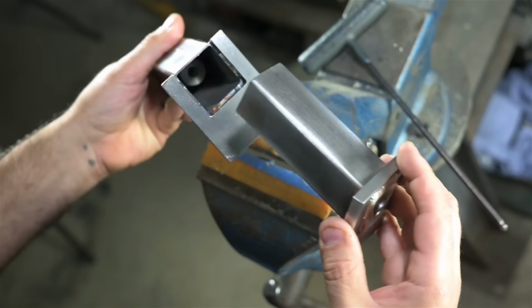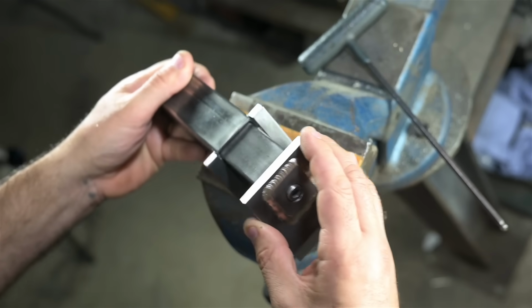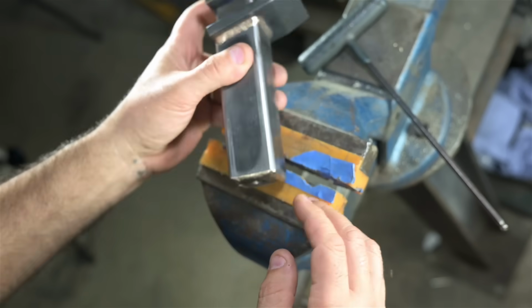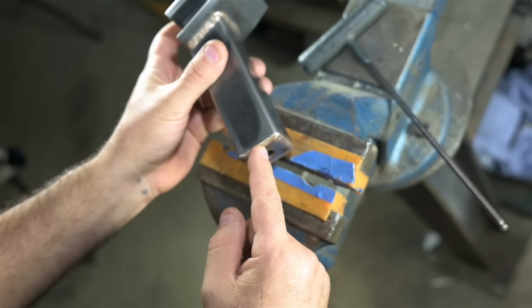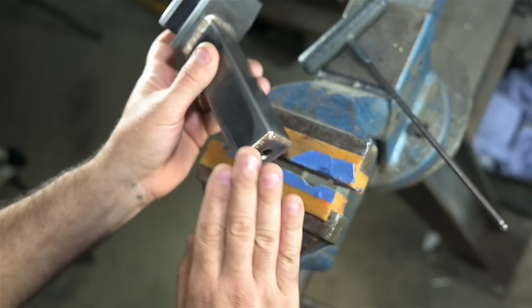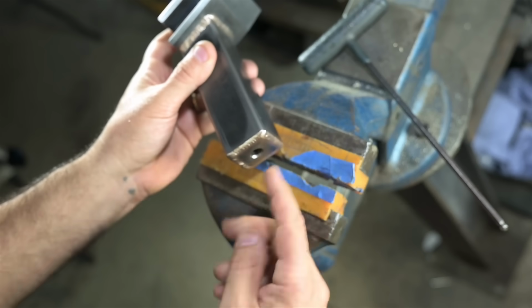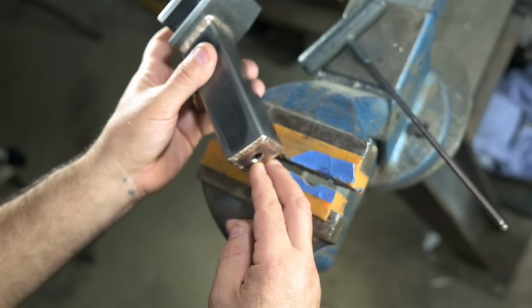Frankly, the reason I thought brazing would have been better is because I think there's less deformation. Like if you put a steel tack on one end, it's going to pull that part out of square pretty hard compared to something like bronze, I think, especially with all that slop that I had in there.